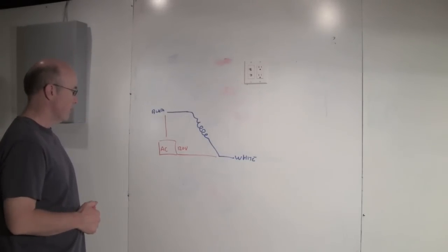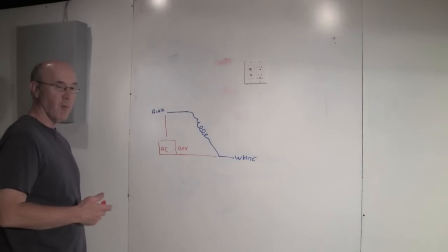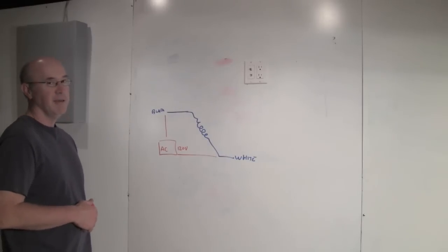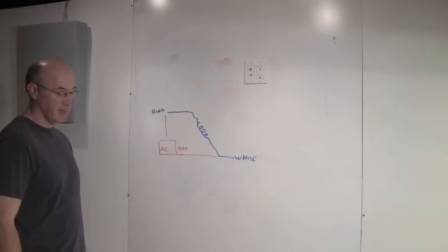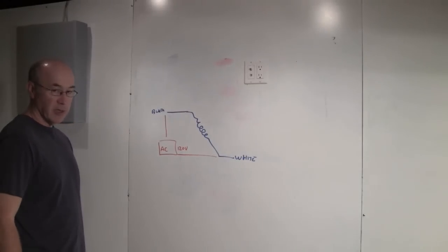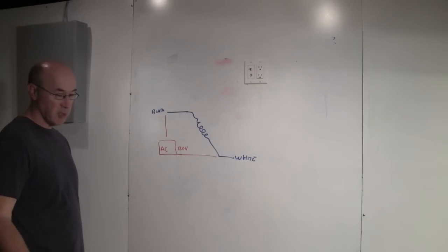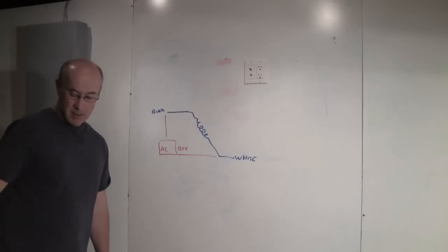But anyway, that's what I observed. So the other thing I actually did in my house, I have two furnaces, so I actually wired the other furnace's fan motor to this furnace's control board. The control board was able to power the other motor, so I figured it probably is the motor. So next thing we'll do is we'll go to the unit and we'll install the new motor in the fan housing, and then we'll install it.